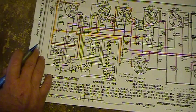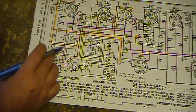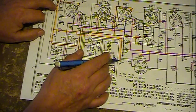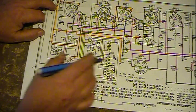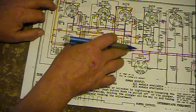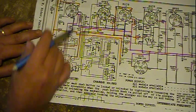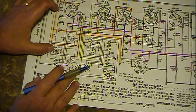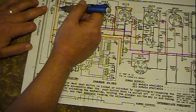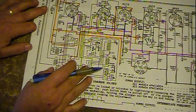For your higher frequencies — the higher bands in shortwave — since there are so many coils, instead of just relying strictly on some of the other filtering which is only way back here (.05 and the 2.2), they added this right down here to make up for it, because this is quite a long ways away. The .01 and the .002 are decoupling caps — what that really means is they're feeding off any unwanted interference or unwanted oscillations, bleeding them off out of the circuit.